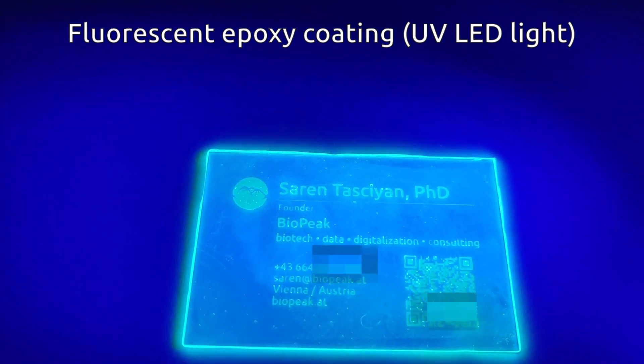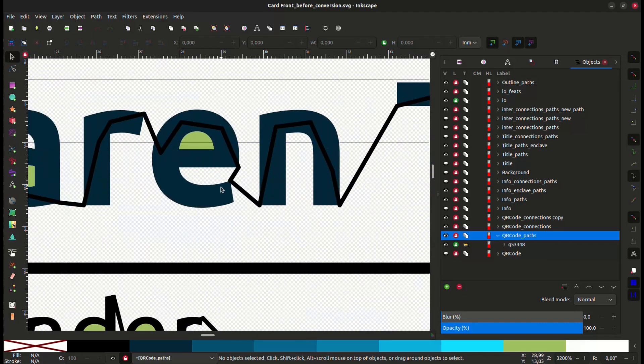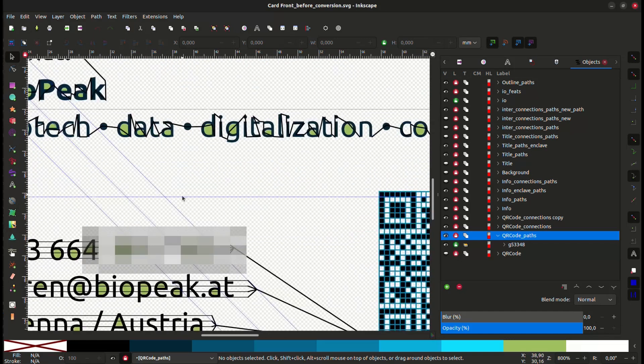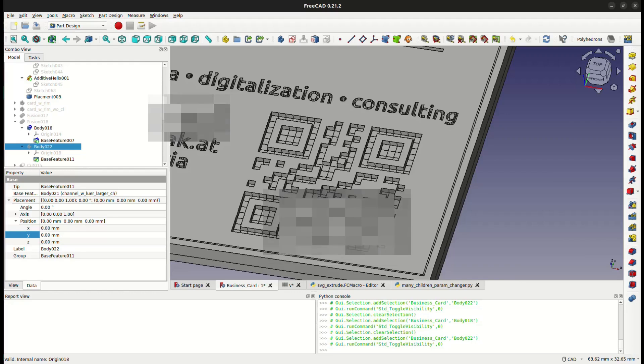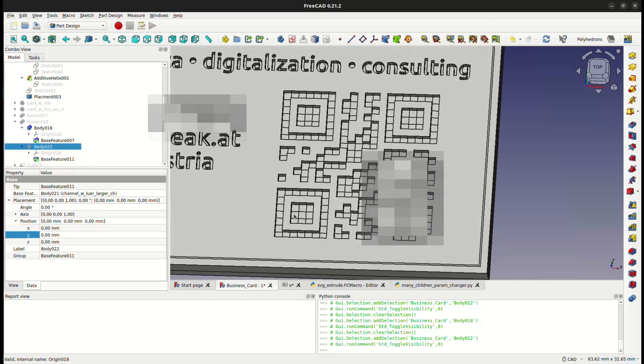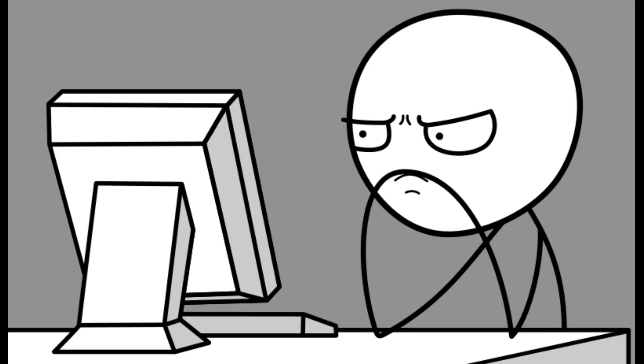Then I introduced the channels and connectors, and here the real issue surfaced. Text is not very microfluidic friendly — all the dead ends in letters are traps for air bubbles. There are ways to go around this issue with pumps, but if I can fix the issues now I should. Besides, the QR code is also challenging in terms of liquid flow. We have some isolated and some connected squares, and some parts will have higher resistance than others. I was pretty sure there would be many air bubbles, but perhaps some pump trickery and tapping could get reasonable results.